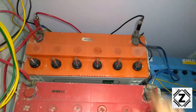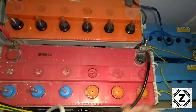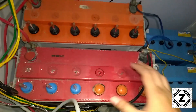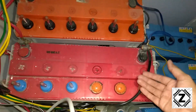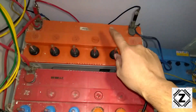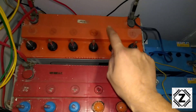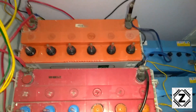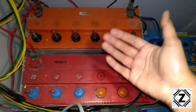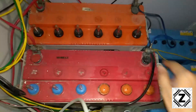The usability of the back battery will be quite low and you won't get the full benefit of parallel batteries. The foremost battery gets quickly charged and quickly discharged, so it ages much faster and wears out prematurely. Once that battery gets damaged, it will drag down the other battery too. In the normal connection method, you won't get the desired output or desired battery life — hence staggered parallel is very important.